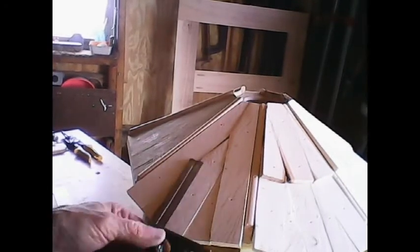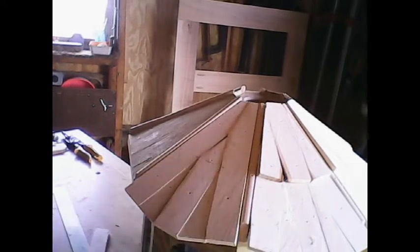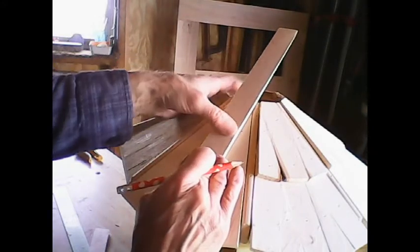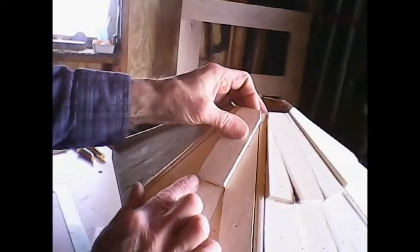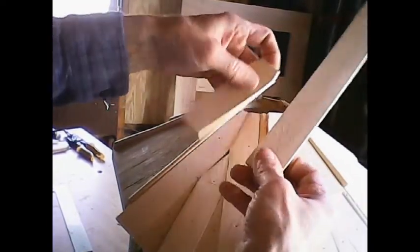For the next layer I come up four inches — that's my reference off the center one. I try to match up a size that's pretty close to the same and bring my middle piece into that line. I do a little roughing in again. This roughing in here is actually going to be showing, so I want to get a little bit closer. Once I have it roughed in where I want it, I can start working on the two side pieces.